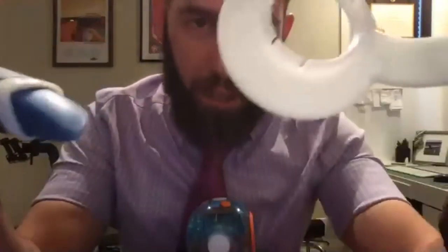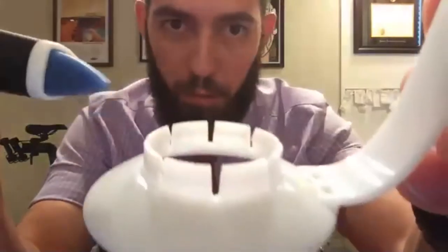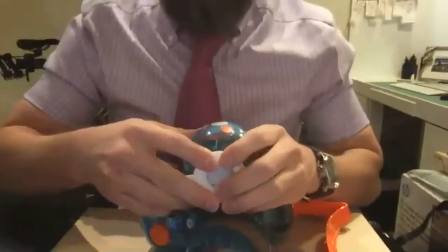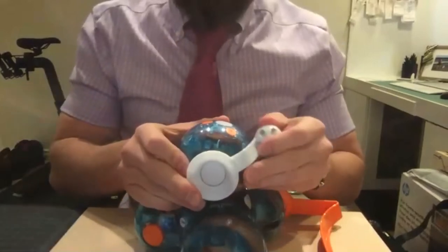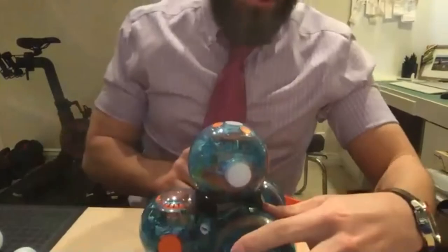Here on this rabbit tail accessory we make, it has a shorter tooth, so it won't take advantage of those ribs we just showed you on the building brick, but it does have those diamond-shaped facets, and those can be stepped through at 15-degree intervals, providing not as much rotational resistance, but more functionality. And it will eject, and then bring it back all the way to what we started with, which is the pusher bar having no rotational resistance whatsoever. So it really just depends on the application, and then you'll take advantage of those features accordingly.